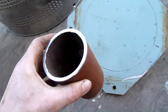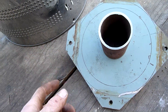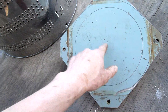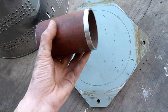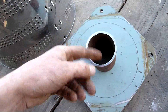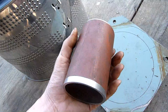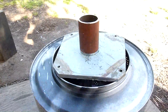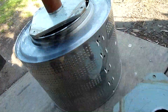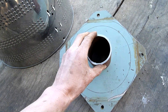The reason for the random pipe turning is so that I've got something I can grip in the chuck to turn the outside. Once the outside's round, I can turn the jaws around on the chuck, grip it from the outside, and do the inside. But for now I need a mandrel, essentially. Either I bore a hole through it, put a couple of dowel pins in it and attach it to a solid block of steel, or I grind all the paint off and weld on a piece of pipe — fire system water pipe — and that'll work just as well. So I'm going to grind the paint off and weld a piece of pipe on, cut it in two, machine it, bevel it, and we've got ourselves an instant arbor. Arbor or mandrel, whatever you want to call it. That should go on centre.